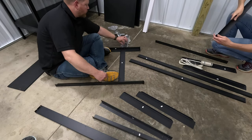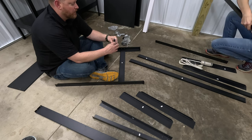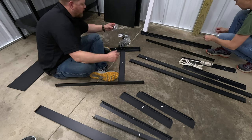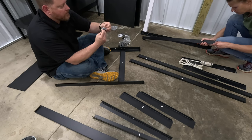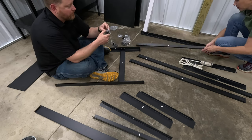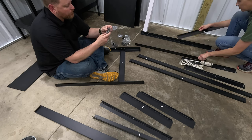There are different size bolts. There's an M6 by 10 — the shorter bolt used for this leg part right now. Later there are longer M5 by 25 bolts — set those aside for now. There's also another set of M6 by 16 bolts that will be used later. For this stage we're starting with the shorter M6 by 10 version.